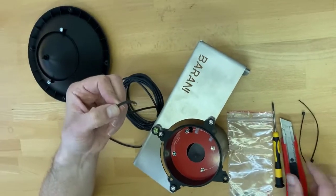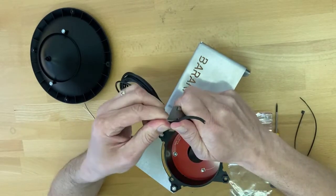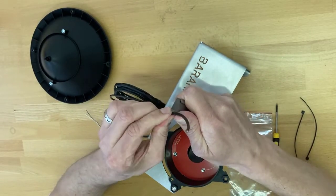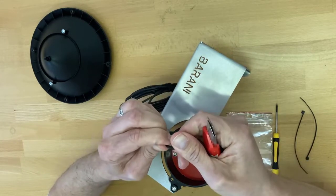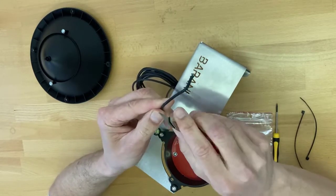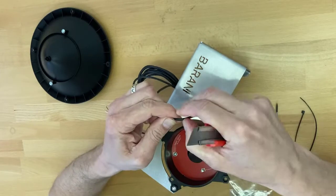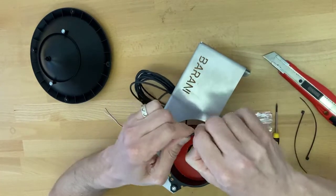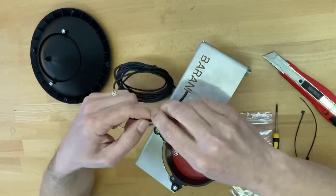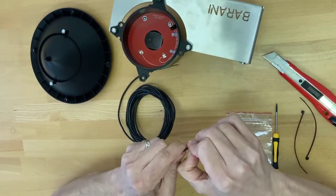Take the wire, keep it in your hands, and just take a knife and spin the wire in your hand under the knife. Then bend it to see whether the cut is made — maybe adjust the cut a little. Now you should be able to, with your nail, pull the wire jacket away off the wire.